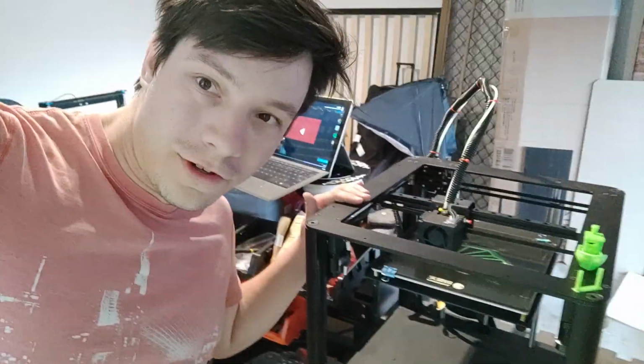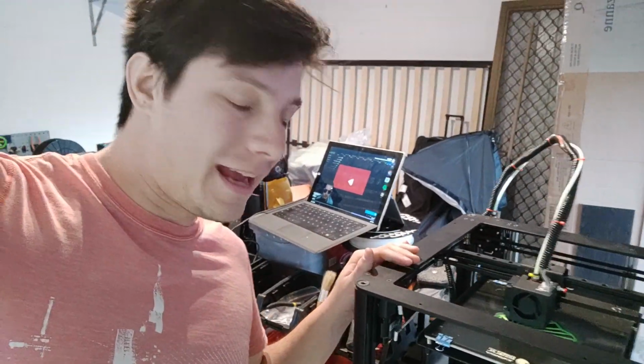Look, if you haven't seen it, guys, this is the Tronxy DO1. And I recently did a review and a video, but really it wasn't much of a review because this machine did not have thermal runaway protection enabled, and it actually could have caught fire. I did have an actual failure during a print, and it kept heating and heating. Luckily, it was right at the end.